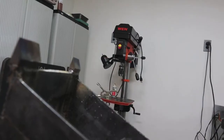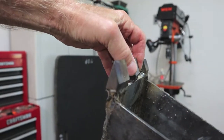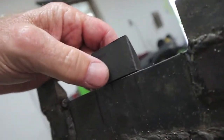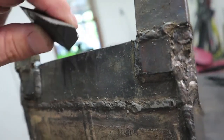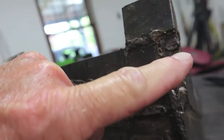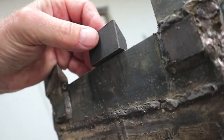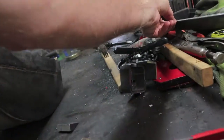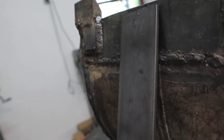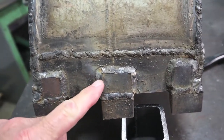I really like that 15-inch drill press. On the teeth, I'm trying to keep them flush on top, and with the overhang on the bottom — it's quarter-inch plate with a half-inch piece of steel on the tooth — I'm going to take a three-sixteenths-inch thick strap and weld it on the bottom. This is one inch on each side because I wanted the sides to come out a little bit beyond flush. Once I get them laid out and tacked in place, I'll fill in that overhang with a piece of plate about an inch long and weld it all up. I went ahead and welded the center tooth on — the plate is only an inch deep.